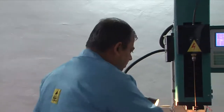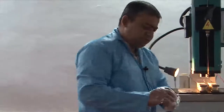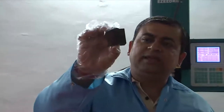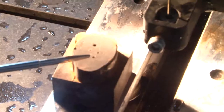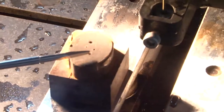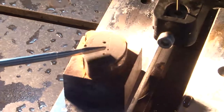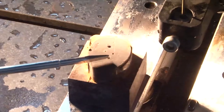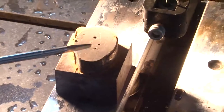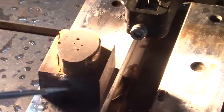This is a module where you can drill very small, very fine holes — and even through holes — in a piece of iron using the process of EDM, electro discharge machining. These two holes shown here are about 700 microns each, and the length goes all the way into the workpiece for about 35 mm.